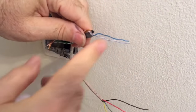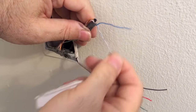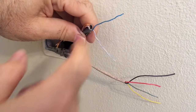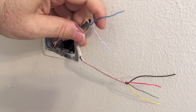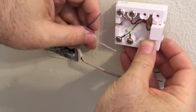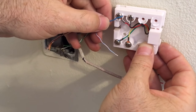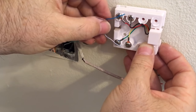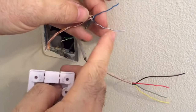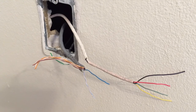If you have commercial wiring, the tip and ring for a single line is on the blue pair. The wire that's more white than blue is called the white-blue wire and is the tip; the darker solid blue is the ring. The way those match up to residential colors: white-blue matches to green (tip), and solid blue matches to red (ring). You'll see this color coding with modular jacks but not with screw post.